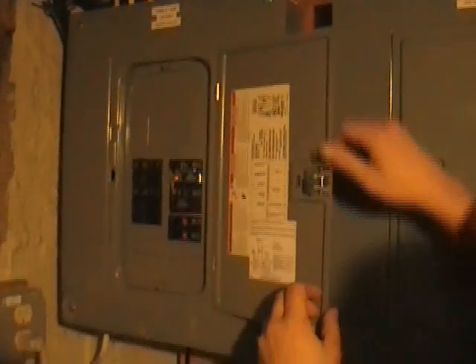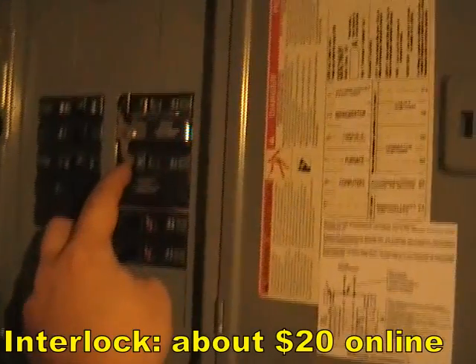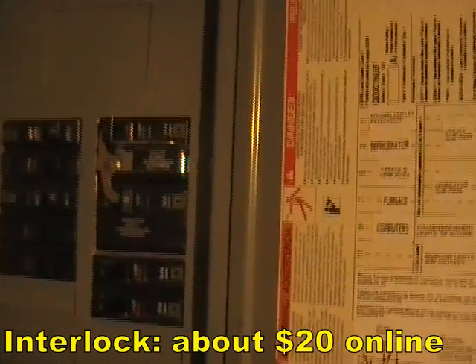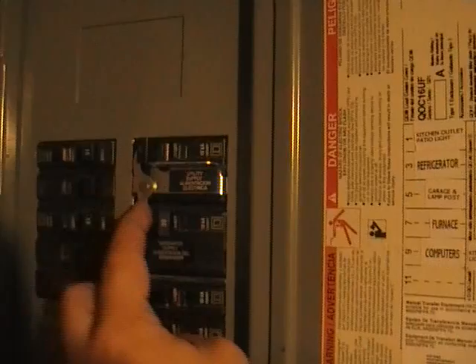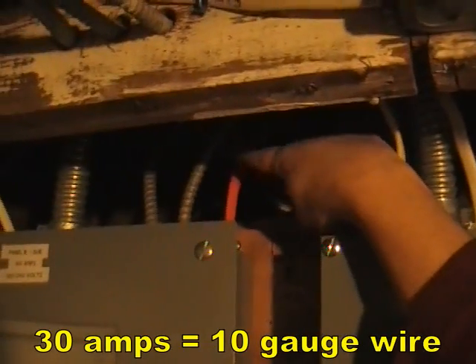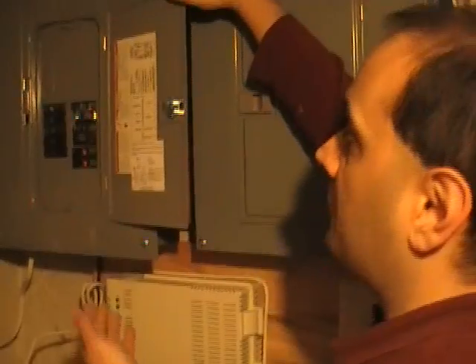Here's the piece that makes everything work: a model Q02 DTI interlock from Square D, who made the panel. This little interlock prevents your utility main and your generator main from both being closed at the same time — a small hi-hat rocks back and forth between them. There's a 60-amp double-pole breaker coming from the main panel, and a 30-amp double-pole breaker that goes via orange cable to the inlet receptacle on the outside. Whenever we want to run on generator power, all we do is flip these breakers and start the generator.